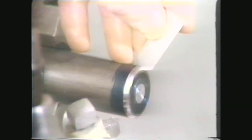When you have turned the radius to the marked size, disengage the clutch, and check for accuracy with a radius gauge. This radius checks out favorably.